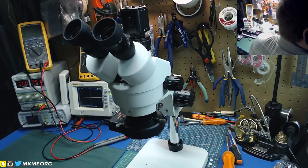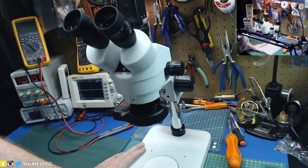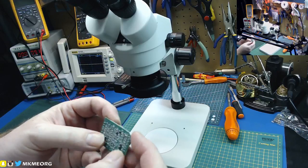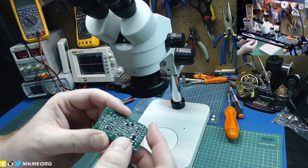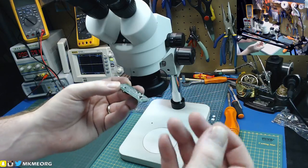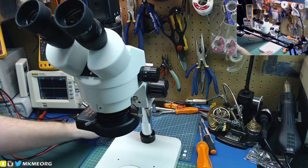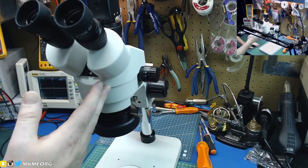It's pretty awesome. Now I can live-stream board-level repairs. This board has 0402 and 0603 components - looking at it under that microscope, I've never seen anything like it, it's a whole different world. It's totally serviceable - you can read numbers on the passives. There's no reason I can't work on consumer stuff now, other than the limitations of my skill and dexterity. It's a big investment at 350 bucks, but not a lot of money for the value. I'd put this at well over a thousand dollar microscope value, truthfully.